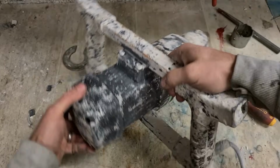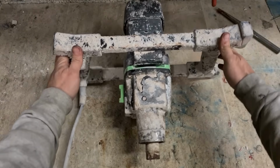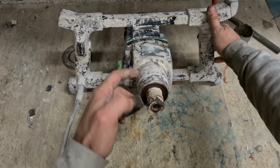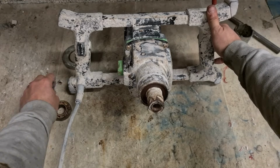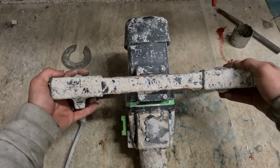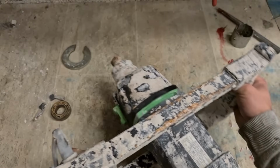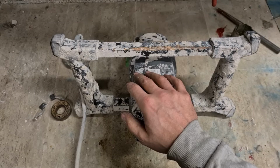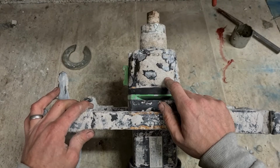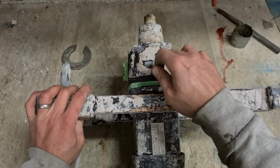Nice one, look at that. One Refina mixing drill with a new bottom bearing, replaced on its own. The rest of them are all fine. Plus a new set of brushes. That'll keep this machine running for a few more years, trouble free. What is she? 2019 machine. So it's one new set of bearings it got 2 years ago, one new top bearing this year, plus a set of brushes. Not doing too bad, must say.